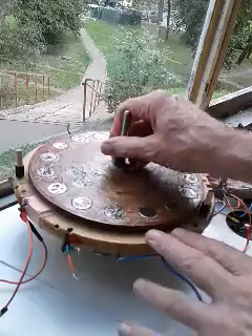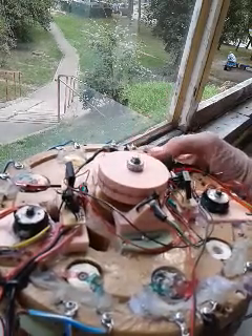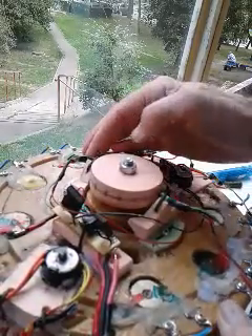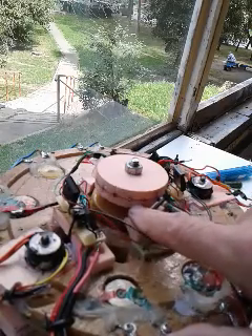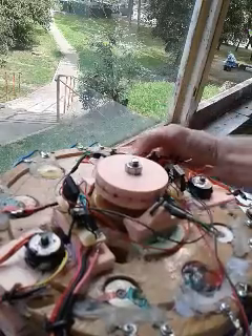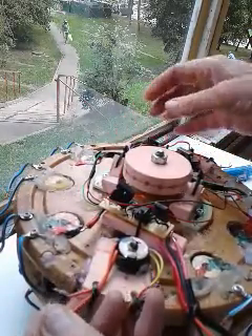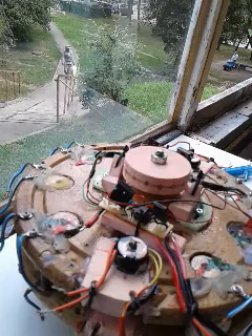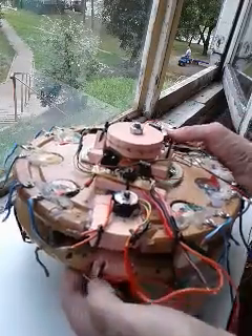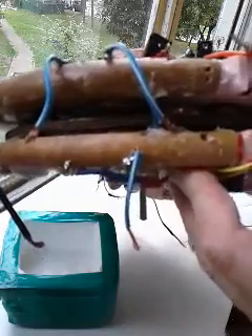Here's the two motor coils below and six generator coils — this all fits in there. Here's the timing disc and a Hall effect here and here. The Hall effects don't fire simultaneously. There are 16 small magnets, about 2 millimeters wide and 5 millimeters long. These fire the motor coils; for the generator coils, the two pickup coils behind have these orange wires at 38 ohms. There's about a 3-millimeter air gap between the coils and the magnets, and it spins really well.